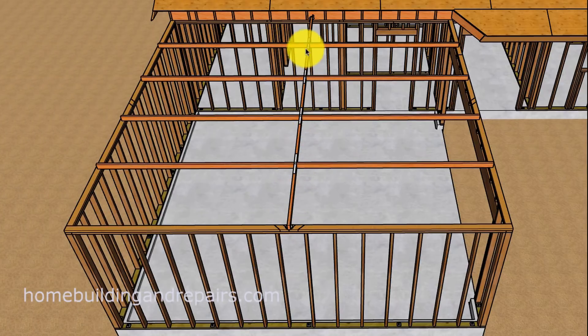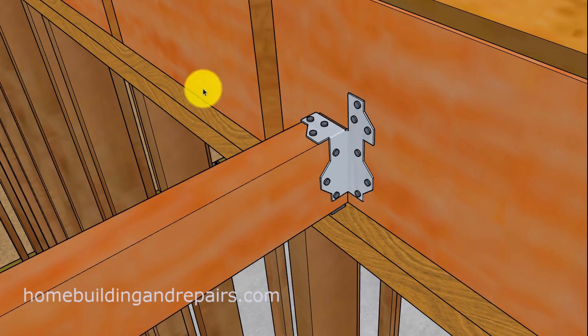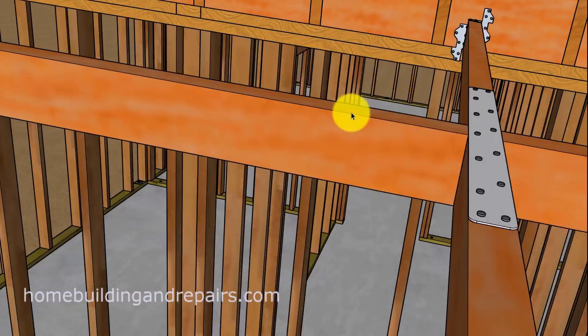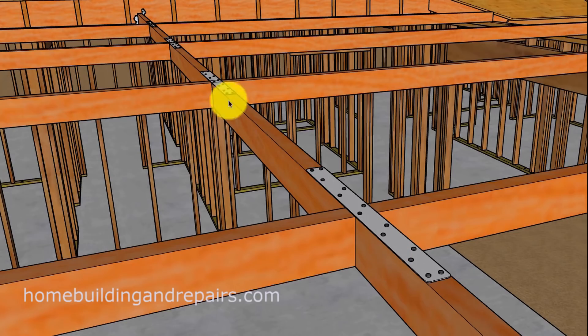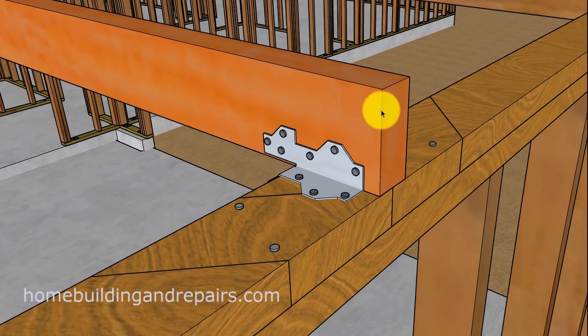Here's a suggestion: if you want to remove the angle braces, you could always put some type of a support down the center and connect it to the wall or the blocks. I'll leave that up to you how much strength you want to create out of this. This might not provide you with as good of a connection as the one on the other end. And of course you will need straps to connect the blocks — otherwise you're not going to have a nice structural connection. Simply put one strap over each of the braces. Come to the other end and this would be a better connection.